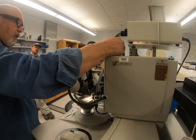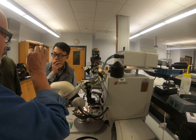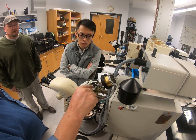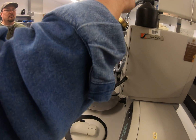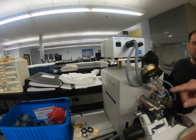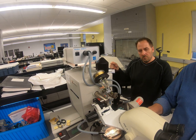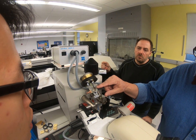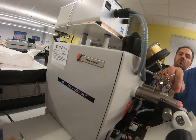Up here is where the wire comes in. We never touch the wire or any area that the wire touches — we never touch this, we never touch that, we never touch this glass plate or anything down here, because finger oils are our worst enemy. The wire comes off the spool, goes through a glass feed tube, goes underneath this glass plate. The glass plate holds the wire at ground potential, because when you're using the business end of the EFO, you want the wire at ground potential.